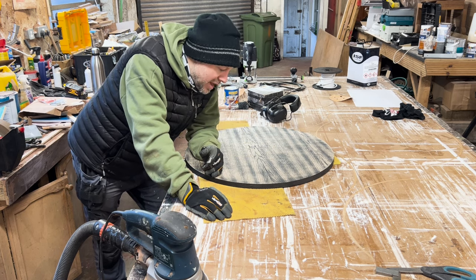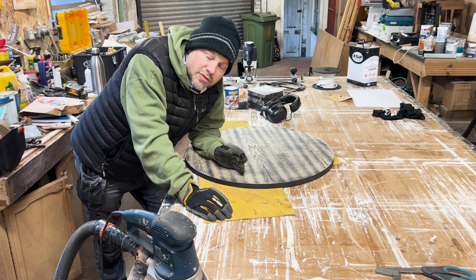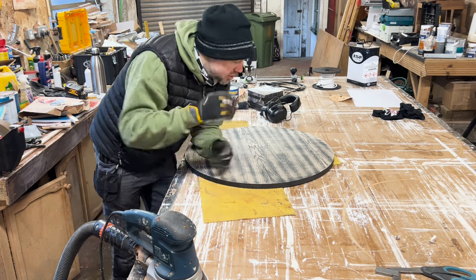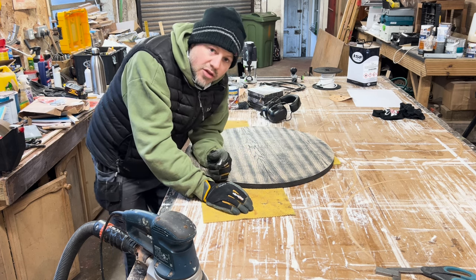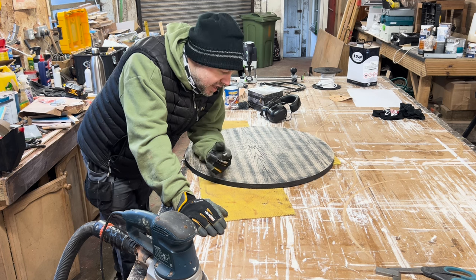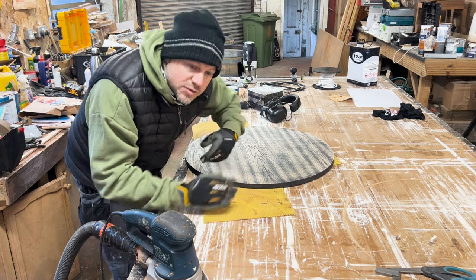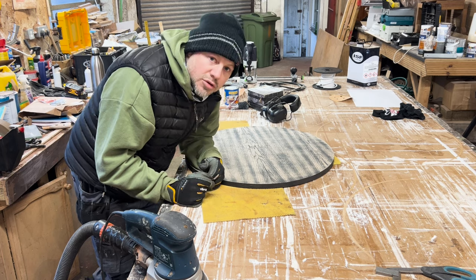on the barrels. So if it had been a piece for a piece of antique furniture, I would have hit it with chains, screwdrivers and stuff to put all the wee dings and nicks in it that a 100-odd-year-old piece of furniture would get. But because this is for the whiskey barrels, you don't need to go that far. So I'll sand the edges by hand, sand the other side, and that should be it, good to go.